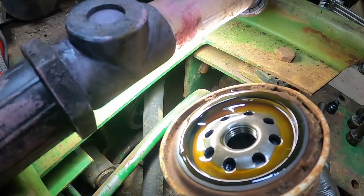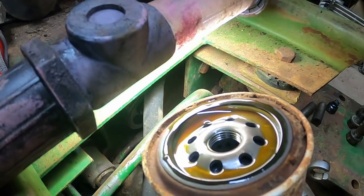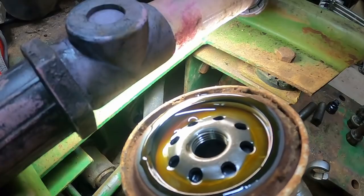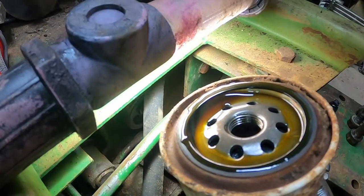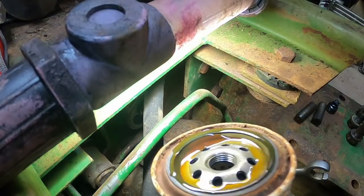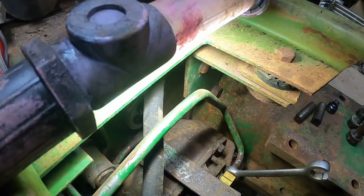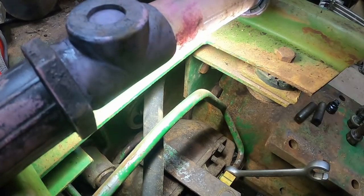And the worst thing that happens is if you get water in your transmission, your gear lube, there's a certain amount of additives in there that suspends that water. That's why it turns kind of milky. And when you get cold weather, all that suspended water turns to slushy ice crystals. And the filter will plug up with those ice crystals and block off, and then the oil doesn't go into the transmission where it needs to be. And next thing you know, the input shaft is seized up, all because there was moisture in the transmission. Check that transmission fluid, change that filter on a regular basis.